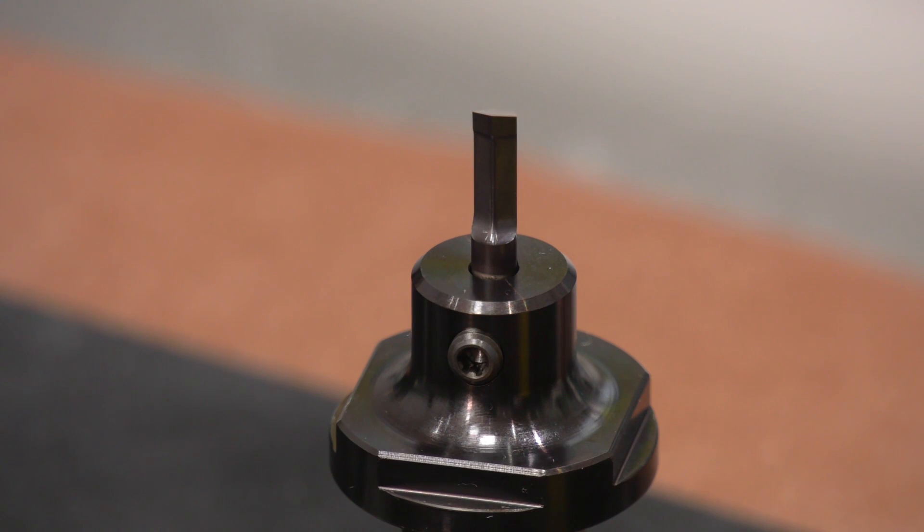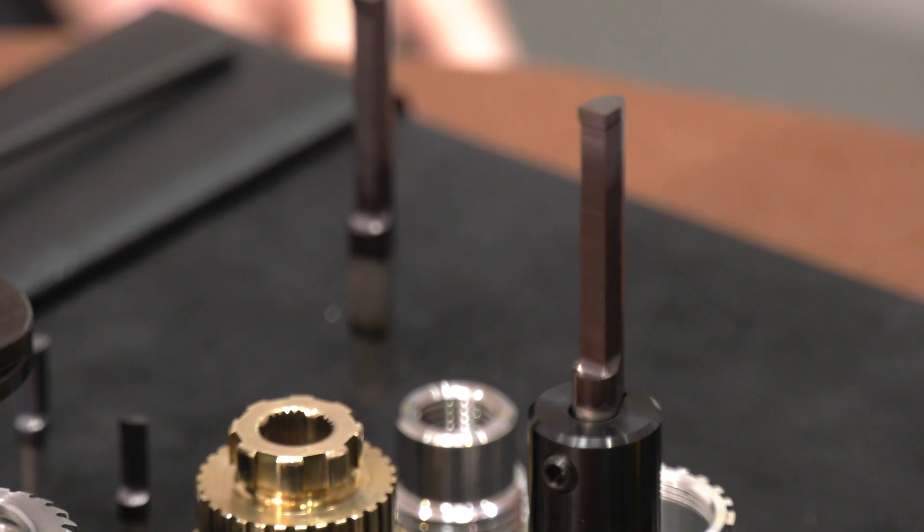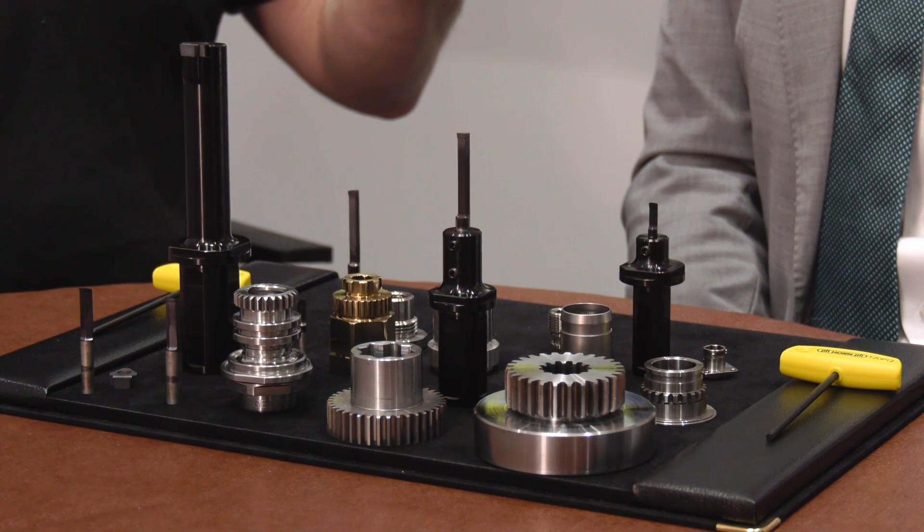You mentioned standard tools — can you adapt any of these as bespoke tools? Yes. Any system you see here, from the N105, N110, or S117, we can adapt all of these to customer-specific special requirements — whether that is an internal gear form, a particular serration, a square drive, anything like that. If a customer has an internal or external form, we can adapt the tool to suit their specific requirements, including the inserts, forms, and tool holders for particular bore entries or lengths of form.